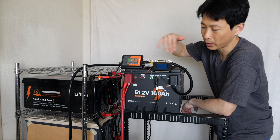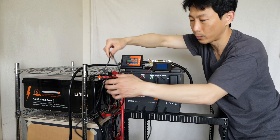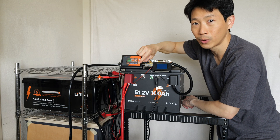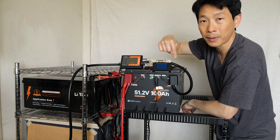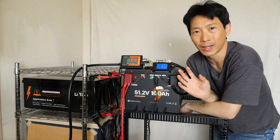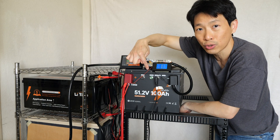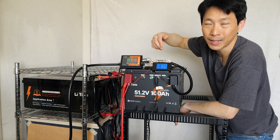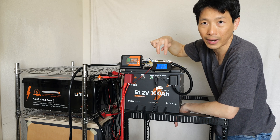Let me describe the display that comes with this. It allows you to plug it in and check the state of charge. There's quite a bit of wiring so you can sneak this all the way to the front control — you can monitor it and turn off the backlight if you want. I've also connected an inline resistor to measure the capacity. It requires two sense wires that go straight to the battery; no current goes through here, it's only sensing voltage. When it consumes no current, the voltage is very accurate. Otherwise, when current flows through the wires there's a voltage drop making sensing inaccurate. The sensing of voltage across this very low ohm resistor is also very accurate.